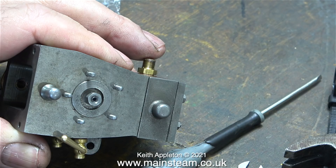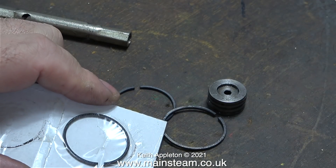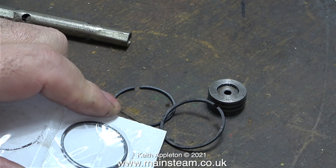I assumed these piston rings to be an exact three-quarters of an inch diameter, but unfortunately the cylinder bore is exactly three-quarters of an inch in diameter, so I have a bit of an interference fit going on. I will think about this whilst I'm unpacking the intermediate cylinder piston rings, and I'm trying really hard not to break them in the unpacking process.